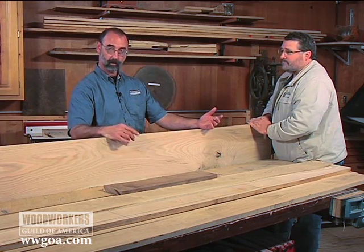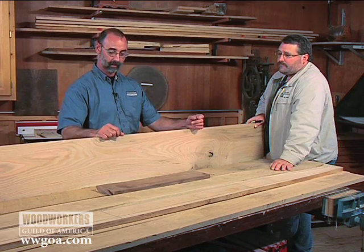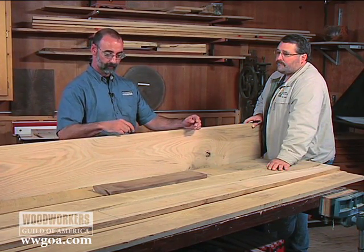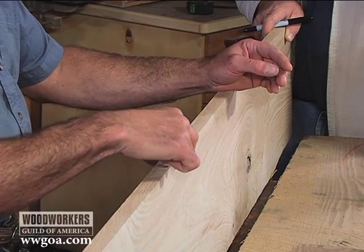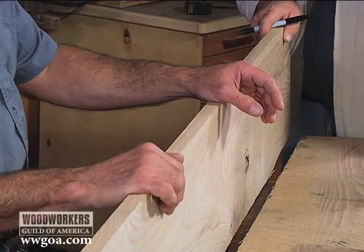That way when it comes in, just like Greg is saying, if you do a glue up, you've got a little bit of material thickness still to work with after the glue up is dry so that you can surface it down. Additionally, specifically on door work, rail and stile work, it gives you a little bit of extra meat in the thickness to get your rail and stile cutters placed into the material, a little bit beefier door.